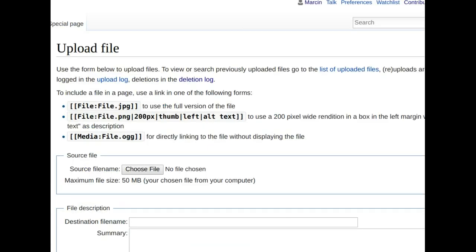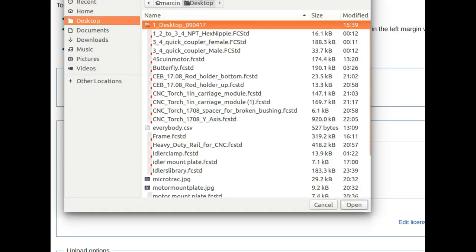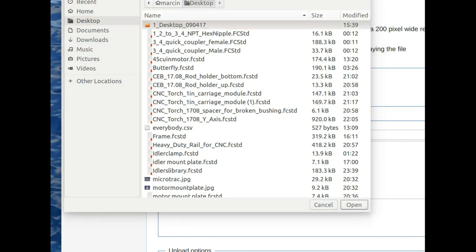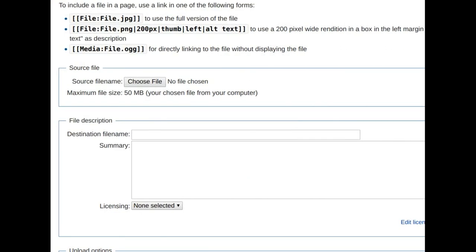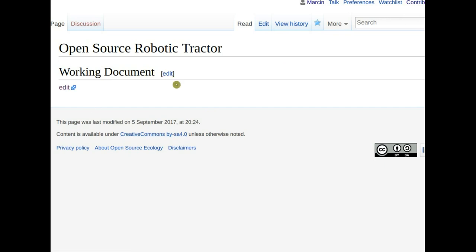Oh, yeah. I see. Tell me a little bit more about the mechanism there. Say one side, there's a yaw or a tilt. You can say the tractor is tilting to one side. How does that affect your measurements? That affects my measurements because I can't see them perfectly aligned, because the camera has an angle from the straight level of the position. So we're going to have an error over the end reading. The robot will be trying to go left and right, trying to align those markers behind each other, and you will never be able to get that right.